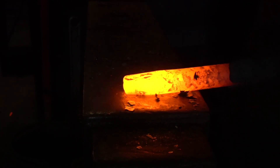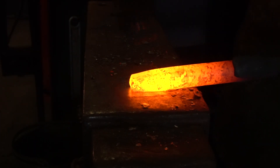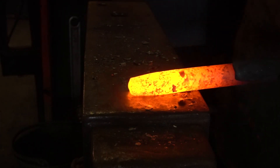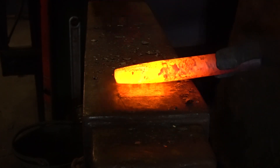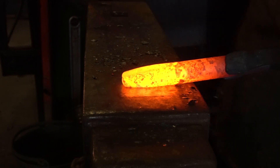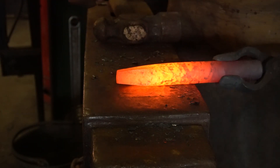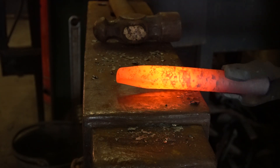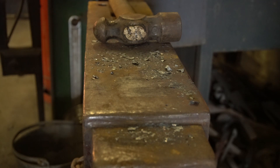Be careful not to burn your stock. Spring steels and higher carbon steels have a lower melting temperature and burning point than mild steel does, which is what we're normally forging. I'm down to about 15mm there. I'm going to take it down to probably about 6mm square on the end and bring my taper slightly further — I'm going to take a nice sharp one.